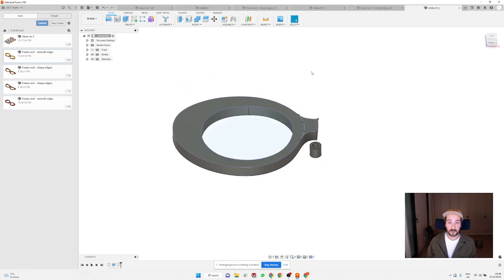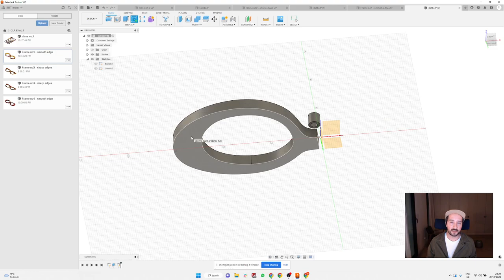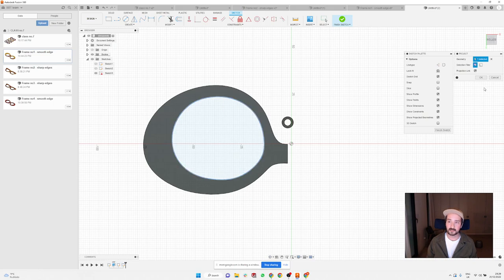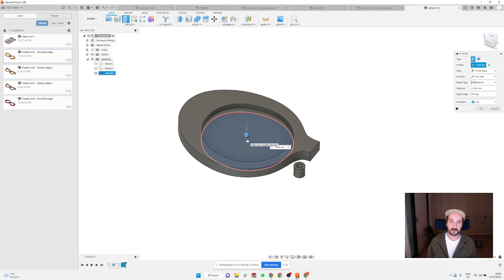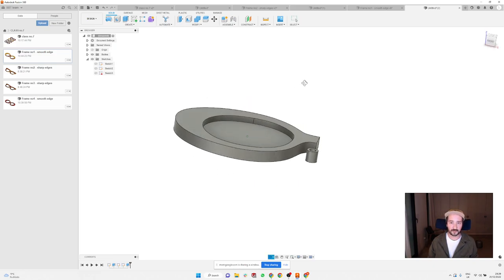So what is the easiest way to do it is if I go on the back, create a sketch here on the bottom again, and then project this lens, and then press extrude and extrude this. Because the frame is 6 millimeters, if I do this recess, I need at least 3 millimeters to have enough mass of the frame to put the lenses. So I think your maximum should be, let's say, -3 millimeters, and that's gonna create the end of that spline.